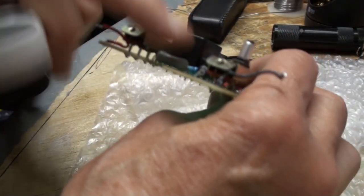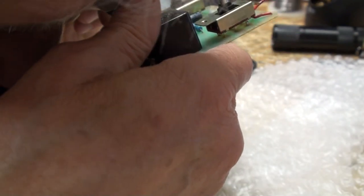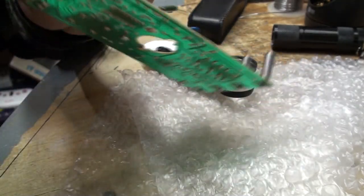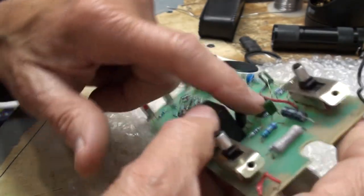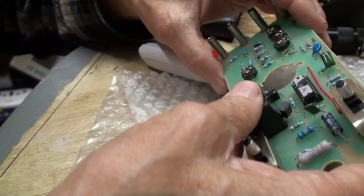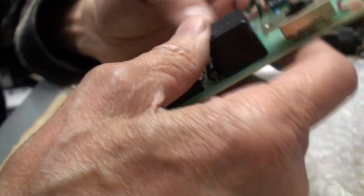There's a 75 ohm resistor right there. I can plainly see that. It's a transistor, but I can't read the number. I'm sorry. Well, you know what I'm going to have to do? I'm going to have to try to get the polarity. You read it from the top. The notch is over here. Of course, the camera's on sideways, so I'm looking at everything sideways here. In other words, I'm looking at the board this way, but you're looking at it over here, so everything's bass-ackwards. I really don't know how you guys do it on close inspection. I really don't.